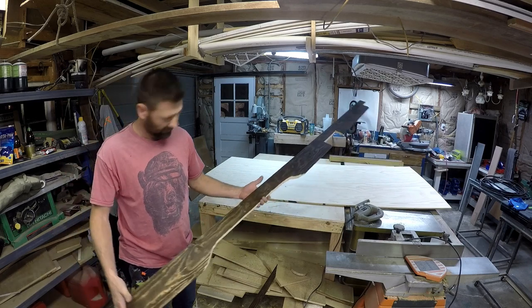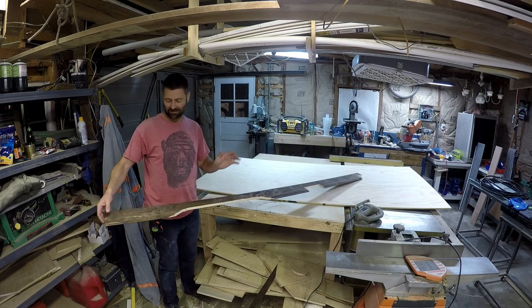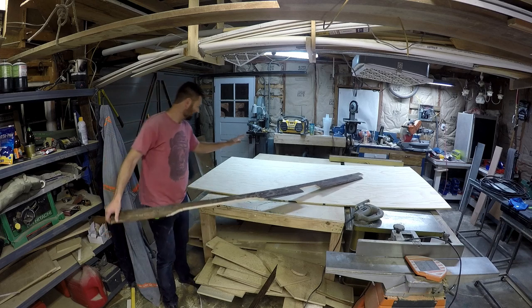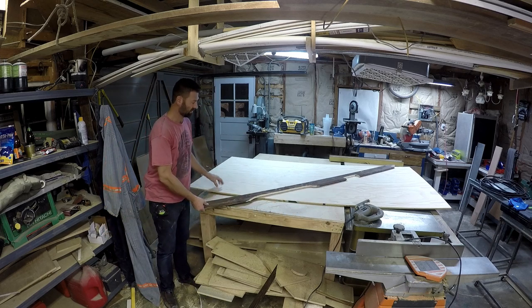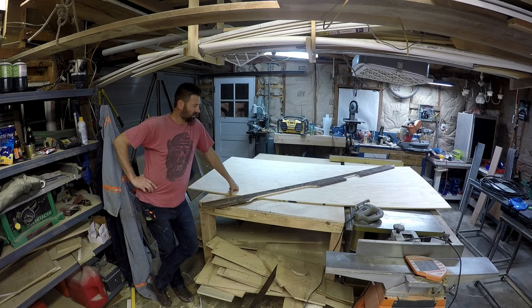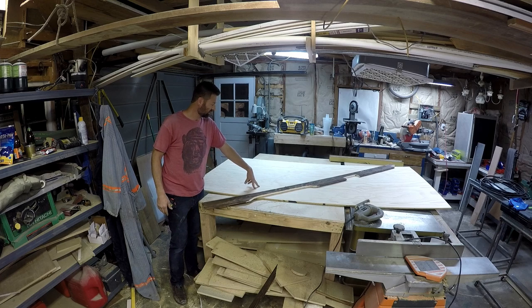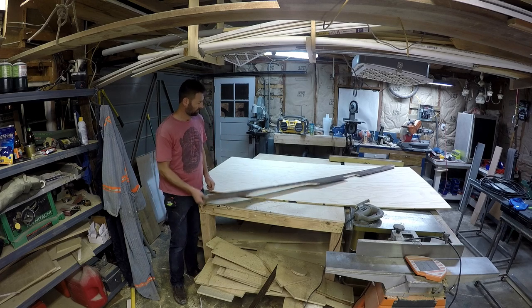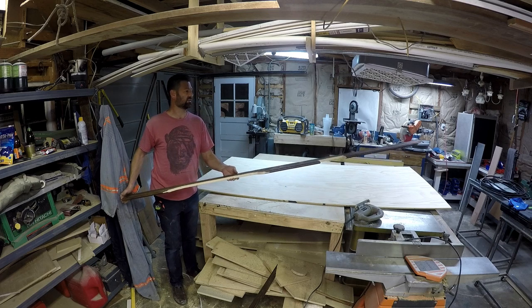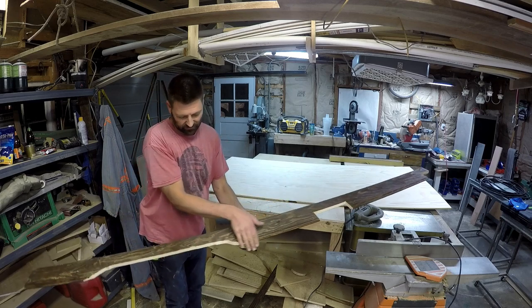This piece of wood right here is a template for the bathroom. The bathroom measures almost exactly four feet by eight feet. So this sheet of plywood — it's a half inch — and this is what's specified by the TCNA handbook on what to do when you have that solid pine plank subfloor. You've got to go a minimum of a half inch plywood over it. So this here is my template. Right here goes in the closet, a little piece of the wall, and this here is the shape of the tub.